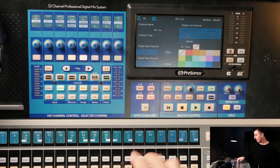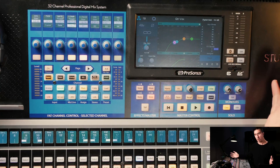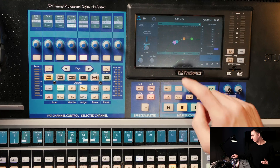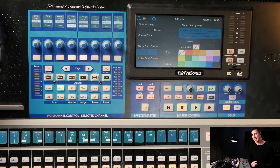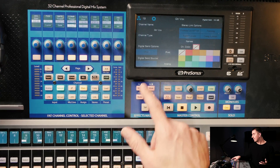The hard part of all this is explained in the other video, and it's not even really that hard, it just takes a while to explain. But here's how you do it if you have a remote stage box for your input rather than one of the local inputs. On your input channel, if we are on the home screen or the input screen for it, we hit this little gear wheel and you can see that it has digital send options — either pre or post — meaning pre-processing or post-processing. And our digital send source, which is what's going out the USB, is either digital or analog.